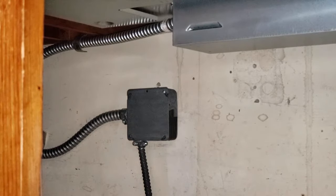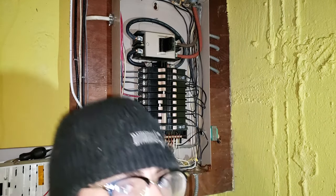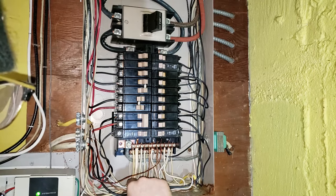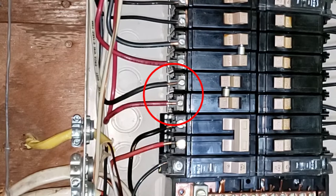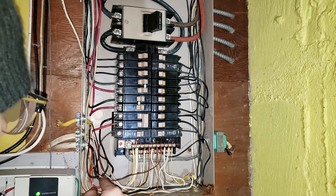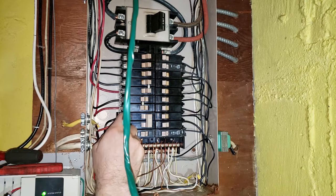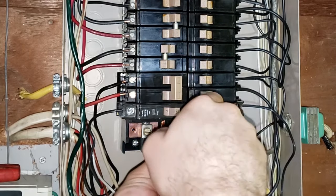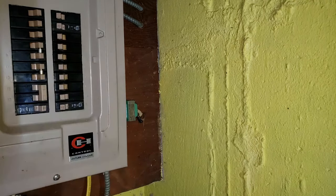And that's pretty much the finished product. Now, if you remember, we weren't done with that green wire. The reason I said that is because we'll have to do the same thing at our breaker panel. Once again, I warn you, everything here is live. So my task here is to locate the same wire that I taped in green tape up top. The way I did that was by locating the breaker for the cooktop, tracing back to which cable these wires go to, and then just finding the white wire. Once I did that, I fished the white wire out so that I could wrap it in green tape and effectively turn it into a ground wire. Because of the age of this house, both neutral and ground wires all go to the same place. This isn't a problem in and of itself, but should an upgrade ever take place, I'm leaving this behind for any future electrician so that they don't get confused. Hopefully you don't have to do this, but if you do, there we are.